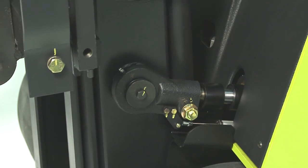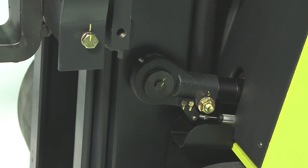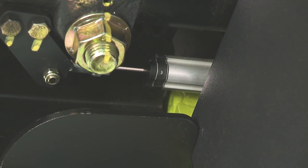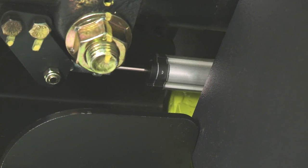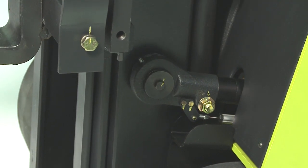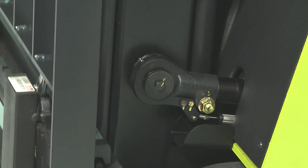The tilt sensor is located underneath the left tilt cylinder. It is a linear potentiometer that extends and retracts as the tilt cylinder strokes. The tilt sensor receives 5 volt power from the tiller card. The 0 to 5 volt output of the sensor is read by the traction control and shared to the pump and valve controls via the CAN bus network. The signal is used by the controls to determine the angle of the upright relative to vertical. The tilt sensor is a vital component to the Productivity Enhancement Package on the ESX that gives the operator features like two-way fork leveling and full range of tilt when the forks are low, even with tall manufactured fork height uprights.